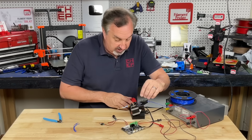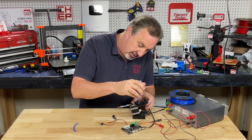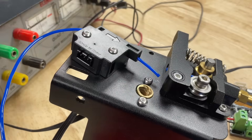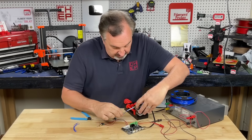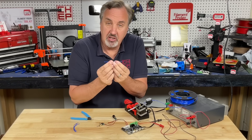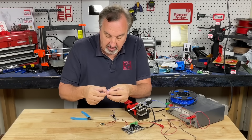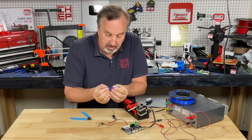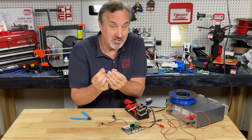I'm not going to use the motor — I'll just manually pull the lever and push it with my fingers until I feel it bottom out on the coupling. Once I've got that, I'll use the clippers to cut it flush to the top of the extruder arm, take the coupling off, pull it out, and I have my base length — uncompressed. I did that three times to calibrate it, and when I compared them they were within a tenth of a millimeter difference. This is a good baseline.